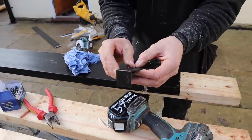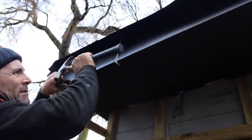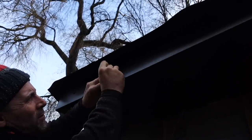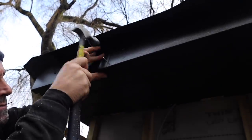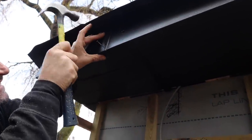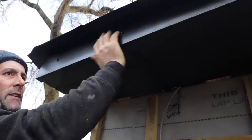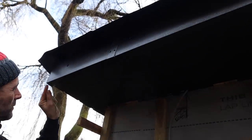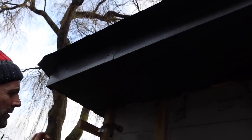There's my fascia on, poly tops in, spaced evenly. I'm going to offer that up — I've pre-drilled my holes so it won't break. There's a nice little finish on that. Now I'm going to return down that side and show you how to cut the corner detail so that the corner capping conceals the joint.